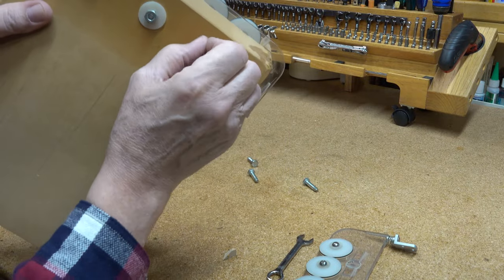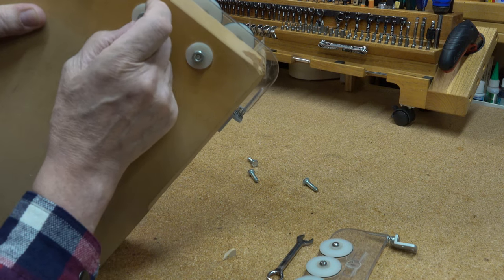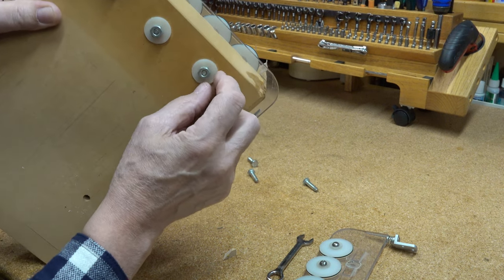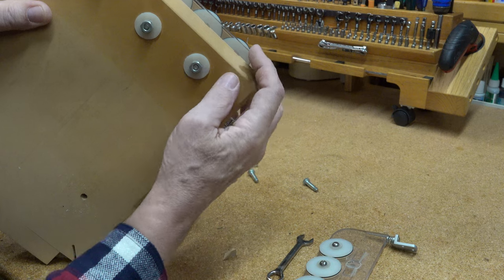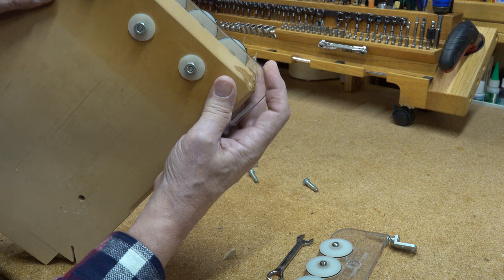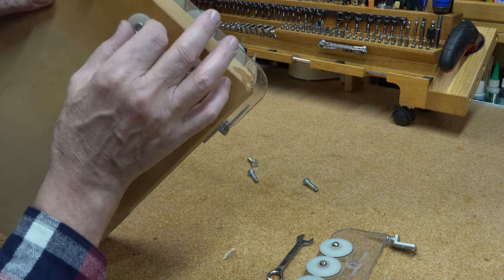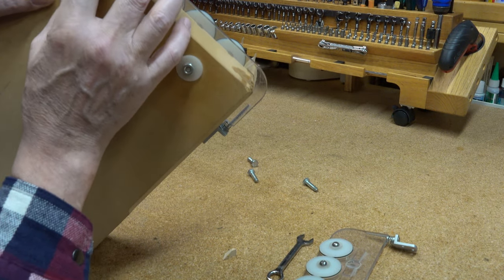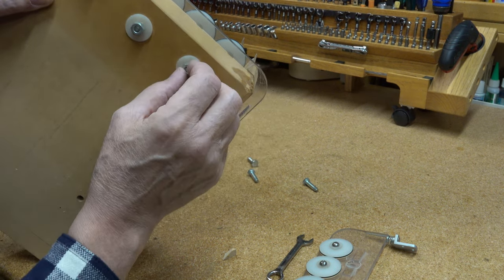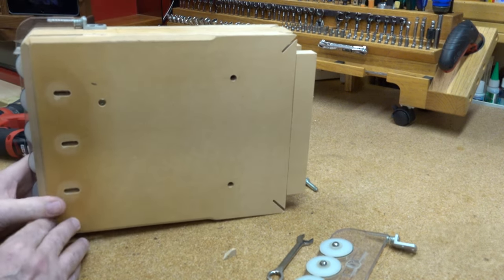Now these are all going to have to be tightened so perfectly that you can still move the washers around — you can still feel the bolt moving just a little bit, but there's still just enough tension that they're not wobbly. Just enough that they're moving around freely, and that's where you want the Loctite to set. Once you have those nuts tightened just right with just a hair of load on there — and I mean a hair — mine are even just a speck loose now, but the wood's drying out and it still works super nice.